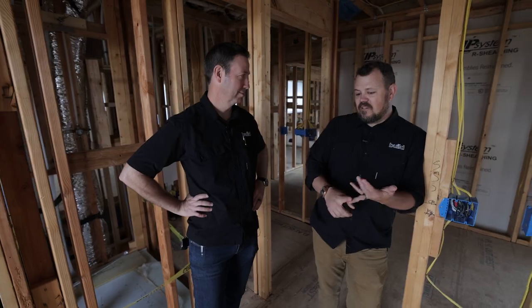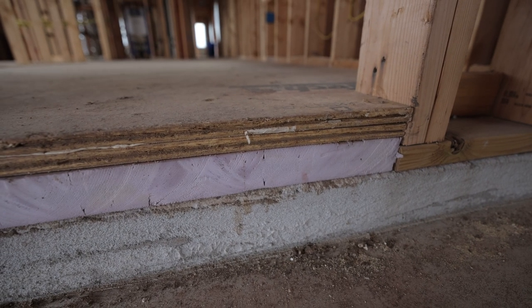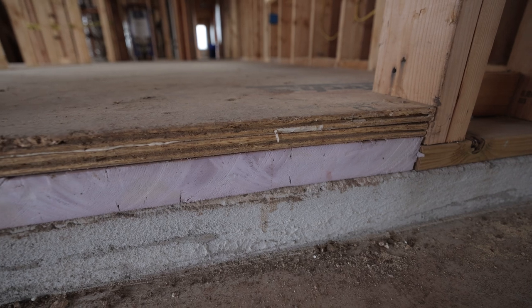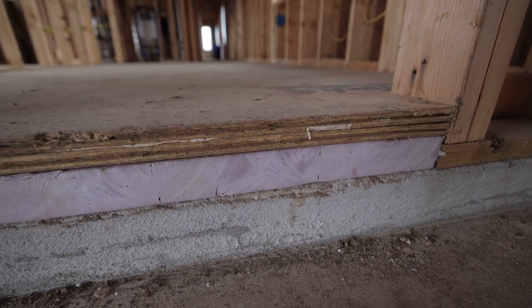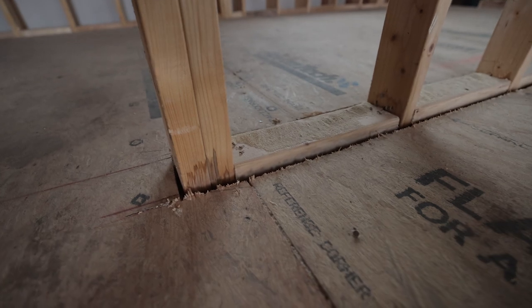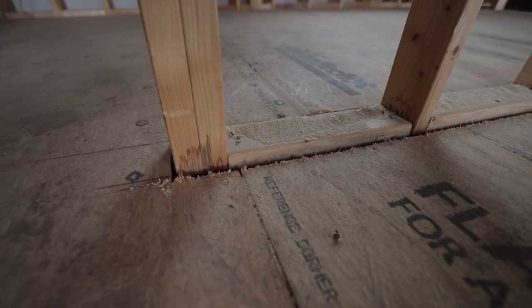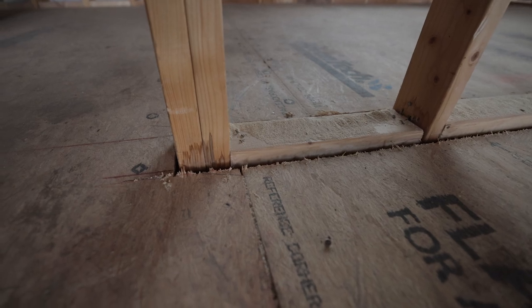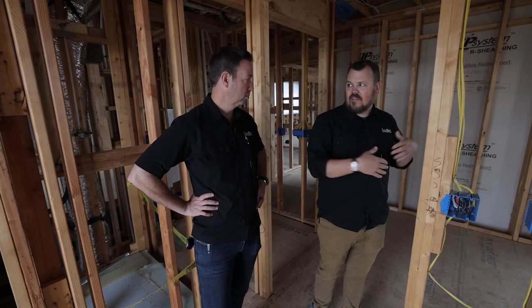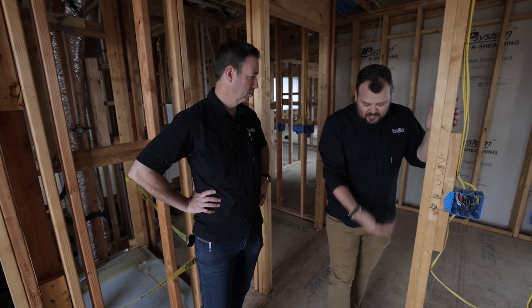And then we have two layers of subfloor. So there's no stringers or furring strips or anything like that underneath here. It's literally raft of insulation, raft of Advantech. Here they've cut it around all the walls. Looks like they did the majority of their framing first and then came back. Yeah. There's some point loads and things like that. In a bunch of ours, all this is open span, all this goes in, and then these are all non-load-bearing partitions so that they can sit on top of this.